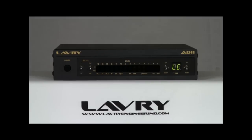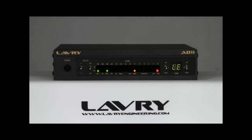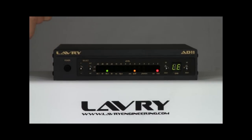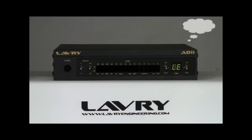To access the settings, there are two switches under the Select heading. The first switch is forward-back and is used to both enter the setting mode and to position the cursor, which appears as a flashing LED. The second switch is Set-Exit. Set is used to change settings. Exit is used to return to the normal operating mode. Anytime LE appears in the gain display, all settings are stored in non-volatile memory, so they are retained even if the AC power is turned off.